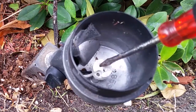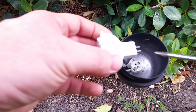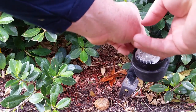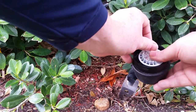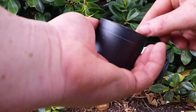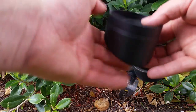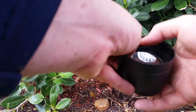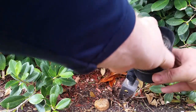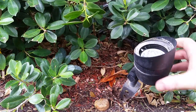I'll check the inside of the outlet and look one last time at the plugs — this is going to fit just fine. I use my fingers at the bottom and let this gently rest on the outlet, then firmly push down with my thumbs. Now I'll set the sight glass back in the top part of the housing, making sure that the gasket seats properly on the inside of the housing. Then I'll turn this clockwise and that one's good to go.